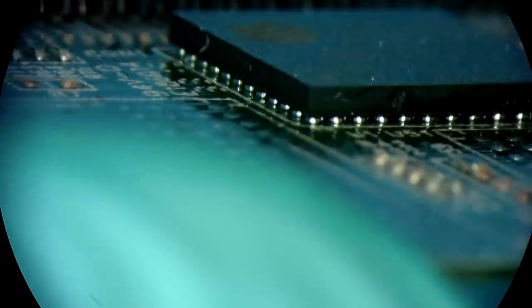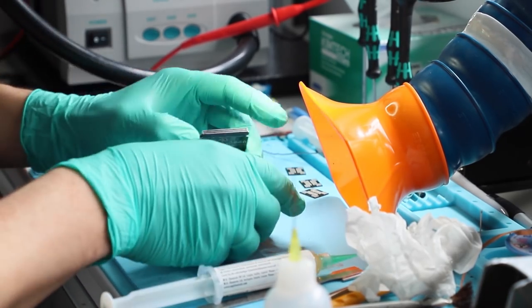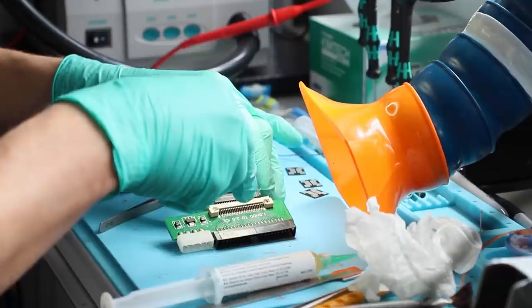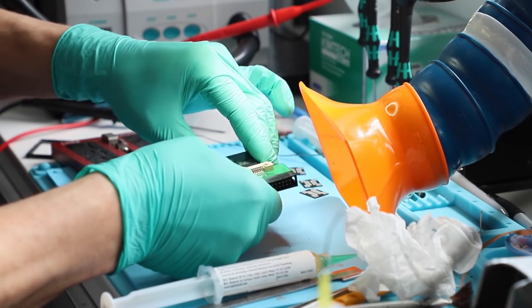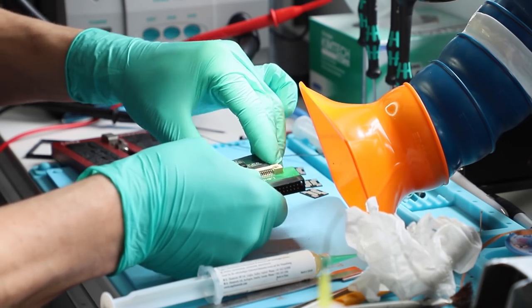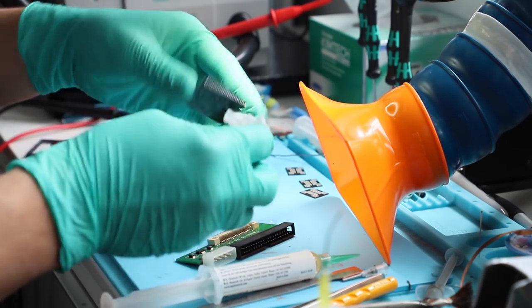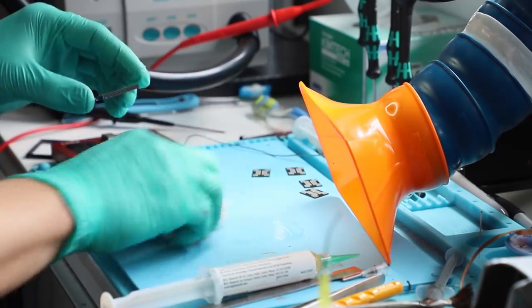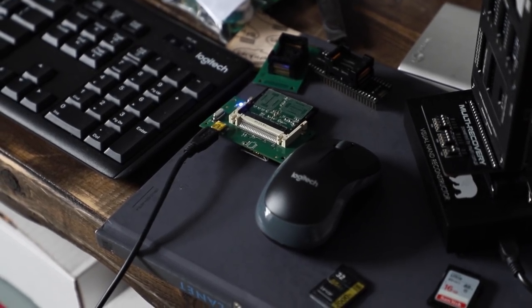Yeah, that's very nice. Just in case some flux might have got in the interface, I always use this dummy connector to kind of clear the path for the one that I'm using for work. So the adapter that I'm gonna plug it into, I don't want to contaminate it with flux, so I just take this extra step. There is our device connected with the USB cable,